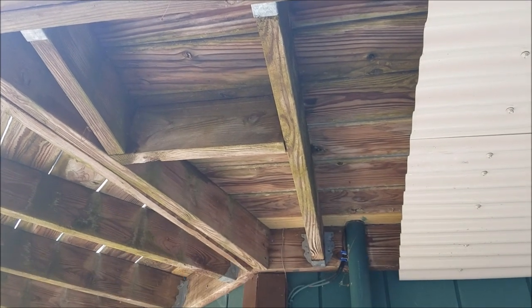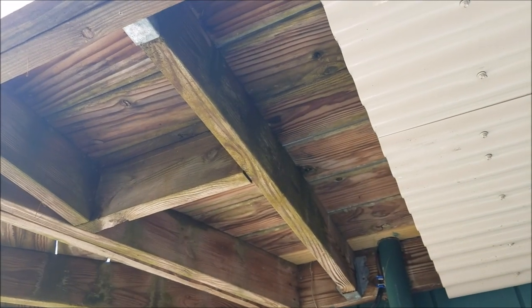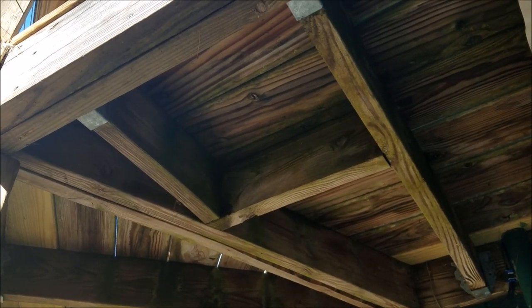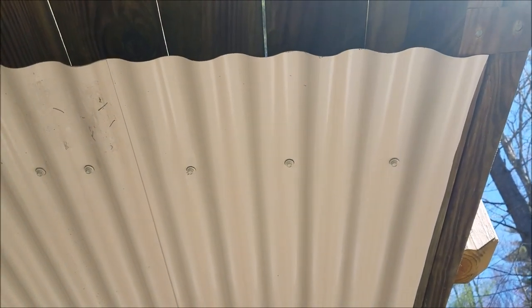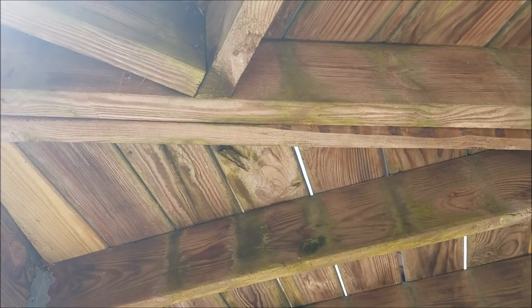Today I'm working on this section. I have a quarter-inch piece of wood to attach to this joist to continue the slope. The adjacent joist with the screws already in was at a half inch, so a quarter inch here continues the slope downward. The last joist at the front won't have any wood at all because it slopes down to that end.